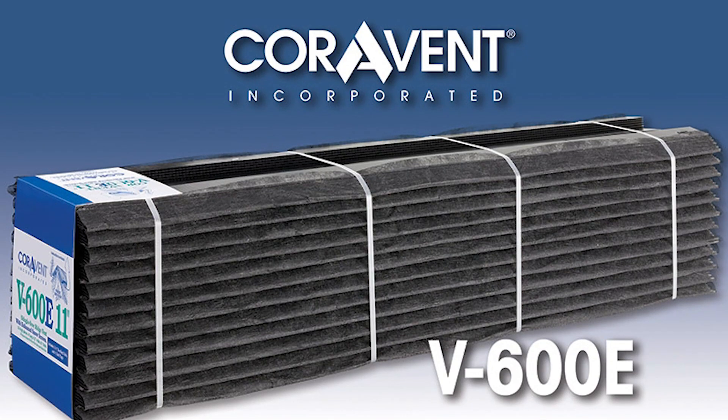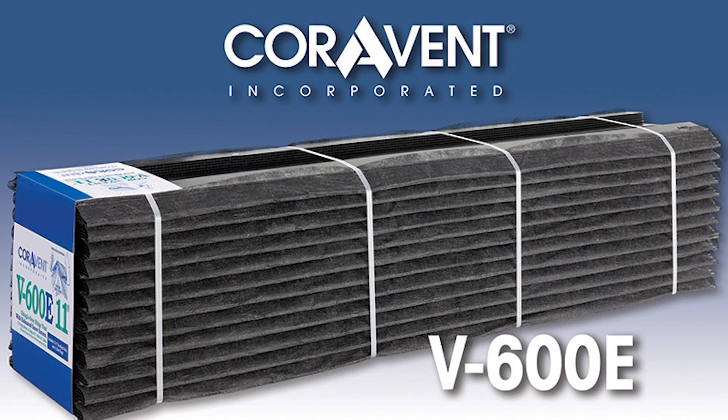Some approaches work; some are absolutely not recommended. One method that is absolutely not recommended is perforations or holes in your Z-closures — it completely ruins your weather-tight capabilities and you don't know how much airflow you're moving. There are products on the market designed specifically for venting metal roofs or the eave systems of metal roofs if you're using an above-sheathing ventilation system. They're usually layered so small holes make it harder for water to drive up through. In areas with heavy snow, there are products with an enhanced snow screen on the front of the baffles to stop anything from driving up through there.